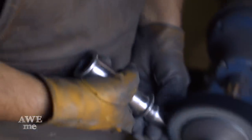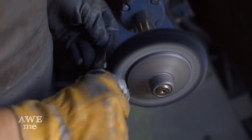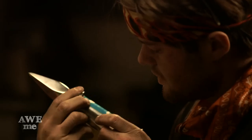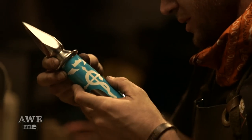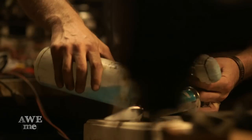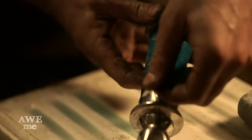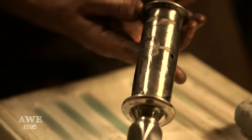We also finished up the butt cap with the square spike end that Chris had welded the rings on. I polished up the rings and determined it looked a little plain. So we looked up the Full Metal Alchemist logo, developed an etching stencil, and electrochemically etched that design into two places on the butt cap, and we'll do the same thing on the socket of the spearhead.